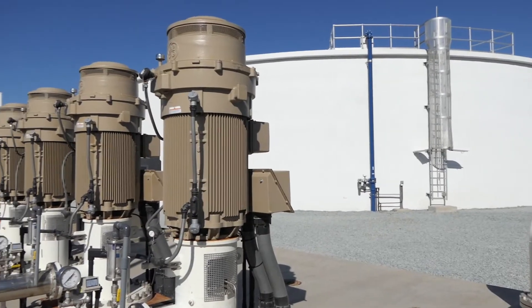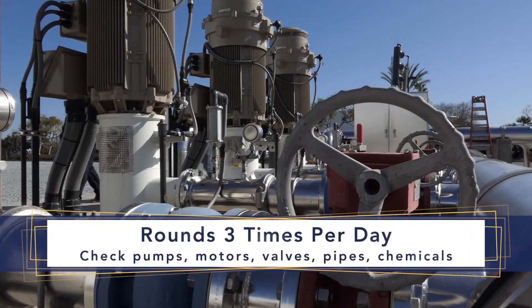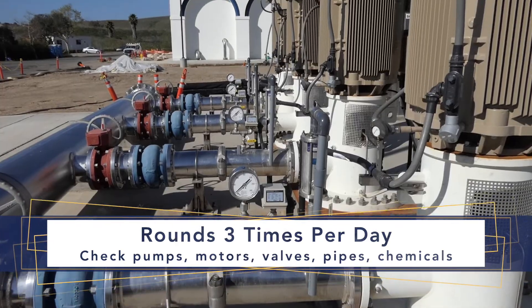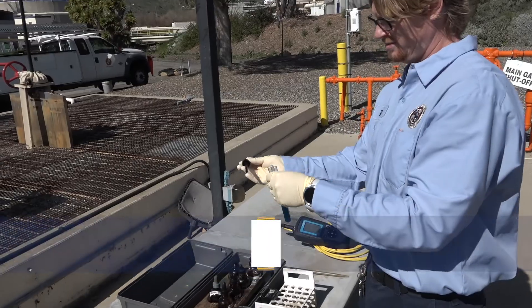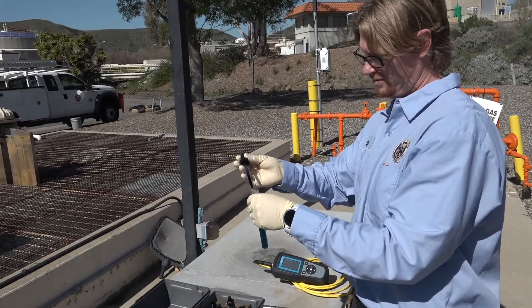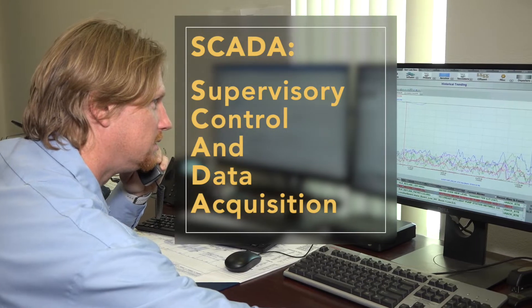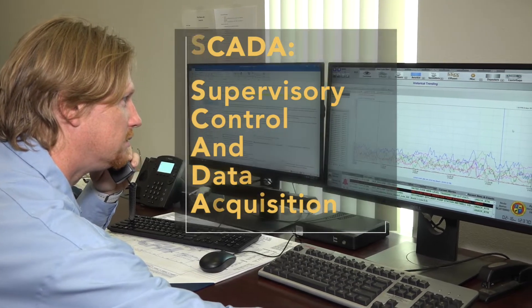If you're doing a thorough job, you're checking all the pumps, the motors, the different areas around the plant to make sure everything runs smoothly, make sure there's no leaks, checking the chemicals, checking SCADA — that's on the computer, that's an overview of everything that the plant is going through and running.